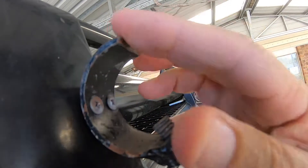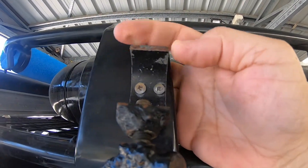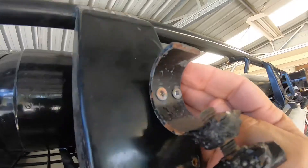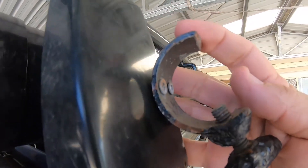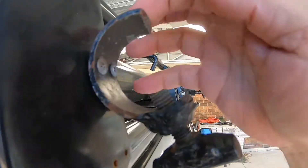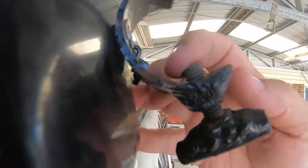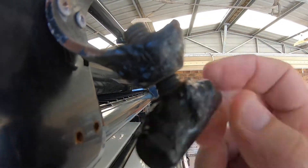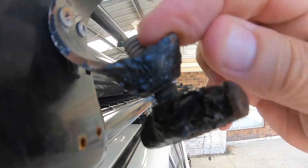It's just a bit of heavy water pipe — this is about 30mm. You can go bigger if you like. It's pretty heavy water pipe as well. What I've done is drilled a hole in the water pipe, put a nut on top of it, and welded the nut onto the pipe.